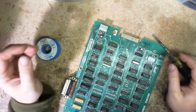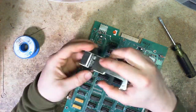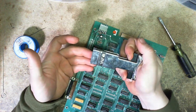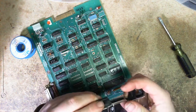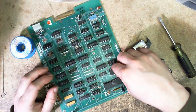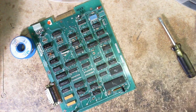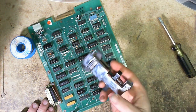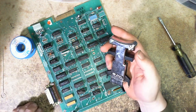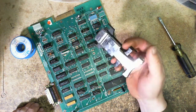I've mentioned before about using screwdrivers as a chip extractor. I thought I had the proper chip extractor for these small ones — no. I keep forgetting I have this chip extractor here. This is great for much bigger chips and ROMs and stuff like that, because it gets into them. That actually fell out pretty easily as well. It works great for the larger chips, stuff like CPUs. For you folks who have ceramic chips, I believe there are knockoffs of it — they're great tools, get your hands on one of these.